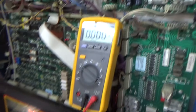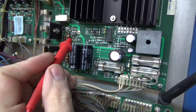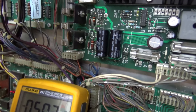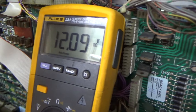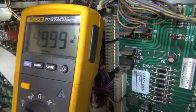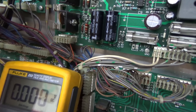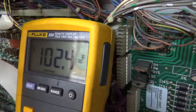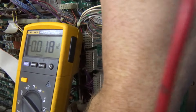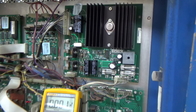We've got it mounted back in the machine, game is back up and running. I'm going to check the voltages: we've got a negative 12 - I think that's unregulated, which would explain why it's nowhere near negative 12. Positive 12 reads 12.09. We've got 5 volt reading 4.999 - it probably goes on to infinity. These display voltages: plus 100 reads 102.4, and negative 100 reads negative 101.2. So that's all pretty good. Our power supply seems to be working just fine with all new capacitors.